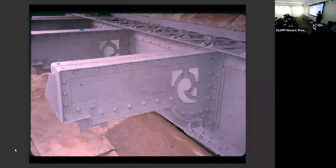This was wet abrasive cleaning, and they have to collect the aggregate because it's lead contaminated, right? And all the effluent has to be collected. Because they use wet to keep the dust down, they use a wet abrasive. They have to use a special chemical called Holdtite that keeps it from rusting immediately as they blast it. And that'll hold it for a period of time until they can paint it. And so it's blasted in sand? Pardon me? It's a water and sand mixture? A water and sand mixture, yeah. It's actually a water and slag mix, but basically a water and abrasive mix.